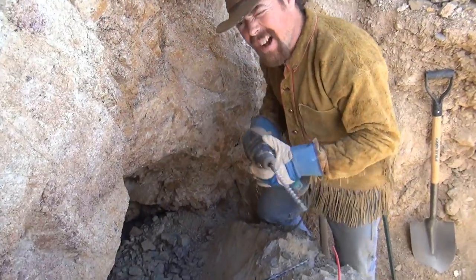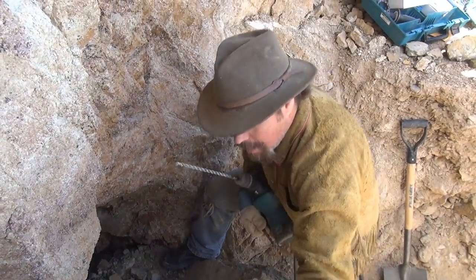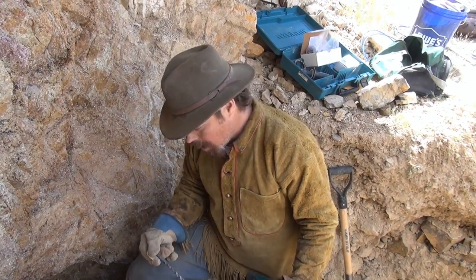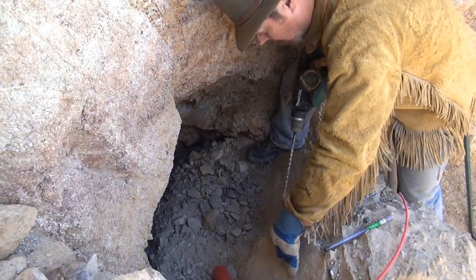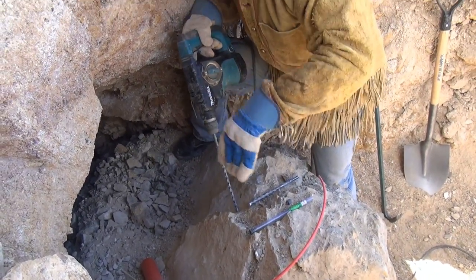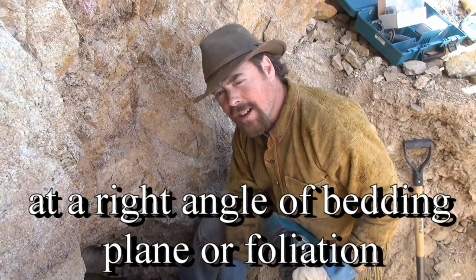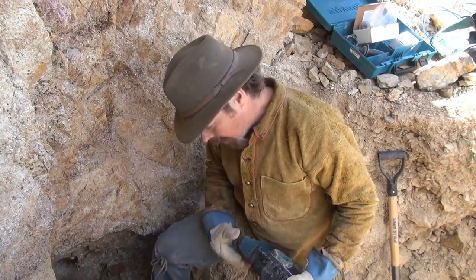Here's your starter bit — see how tiny it is — then your intermediate, then a decent length. If you can afford it, get as many of these as you can; they're not that expensive at Lowe's, Harbor Freight, or Home Depot. If you're going to drill a bunch of holes for four or five heads — you can fire up to ten — rotate your bits to keep them cool, because they'll wear out super fast. Also, if your rock has a flat bedding plane like this limestone, or a linear surface, drill at the same angle. I found I can fracture the rock better drilling at the same angle as the bedding plane. With metamorphic foliated rock, do the same — the blasting will be a lot cleaner.